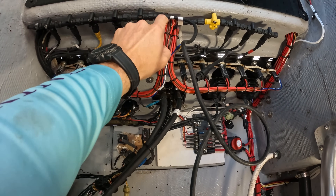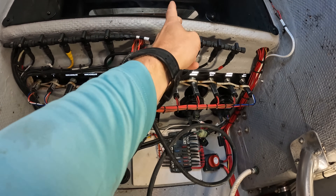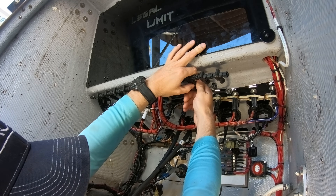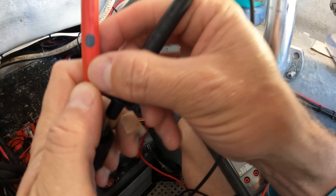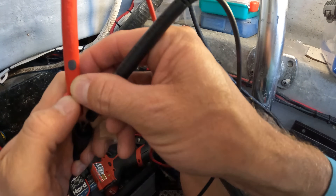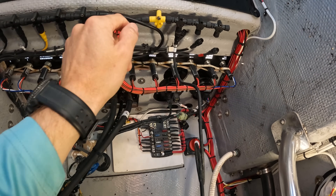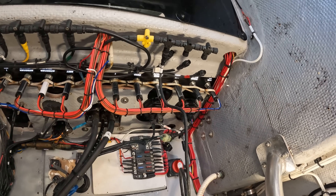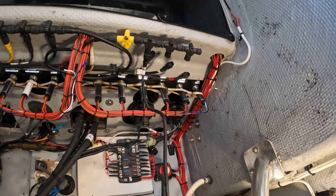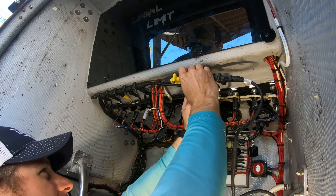So what we're going to do is hook this back up, unplug these two, plug our cable into this one, and then check resistance going from each connection all the way down the line to see which one adds that extra resistance we saw on the network. We're getting 119 ohms — the T-fittings and the isolator still look good. It went up one ohm, but that's nothing to be concerned about. Now I'm going to move this over and plug these in one at a time while watching the resistance.